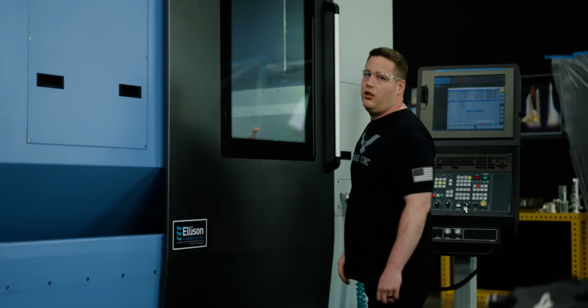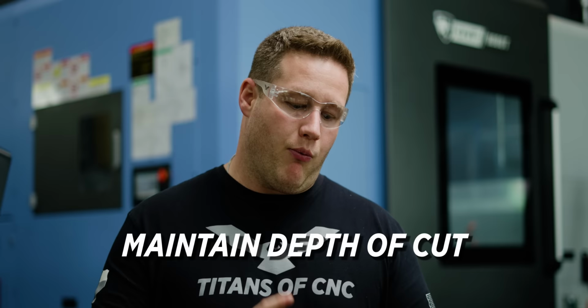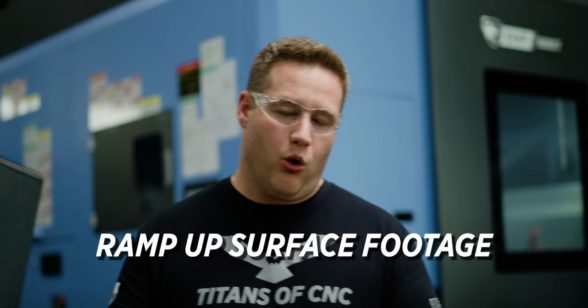Hold on, hold on, hold on. We're going about this all wrong. I keep slowing things down, but it's not getting any better. So that's telling me I'm going the wrong way. So here's what I'm gonna do. I'm gonna cut my step over in half. I'm gonna maintain that full axial depth of cut. I'm gonna ramp up my surface footage, and then I'm gonna increase my feed rate up to 600 inches a minute. Then I'm gonna have me a Celsius because me and this machine's about to get buck wild.